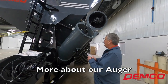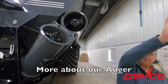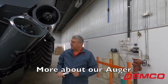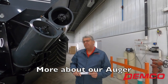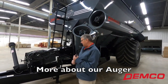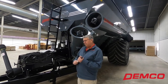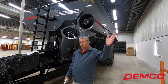When we fold this auger out, it comes 11 feet ahead of the front of the box, so when you're sitting in your tractor, this auger is right out in front of you. Before designing this cart, we spent a lot of time talking to dealers, farmers at farm shows, and farm visits — asking what they wanted to see in this next generation of grain carts. We compiled that information and took it to our engineers. One thing mentioned many times was the forward reach of the auger — it's much easier on the grain cart operator to look out his side window versus looking way back.